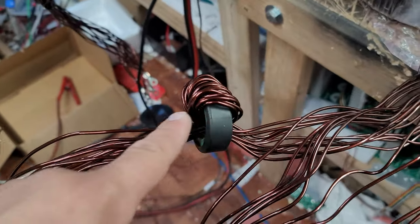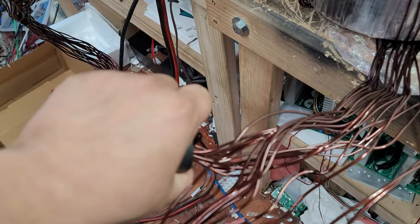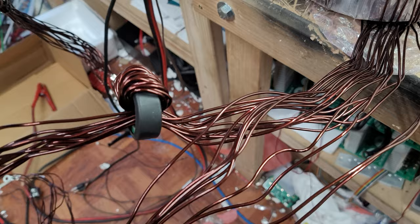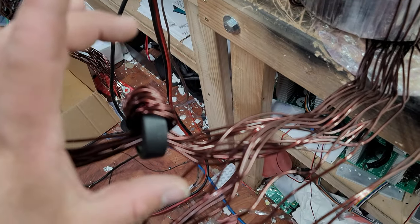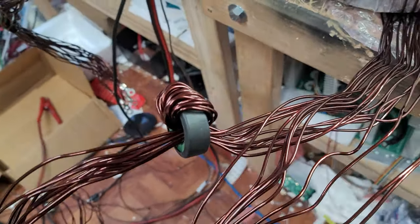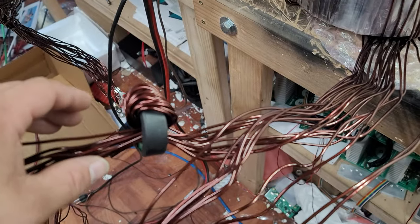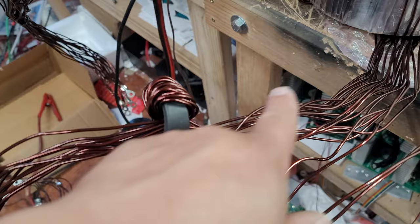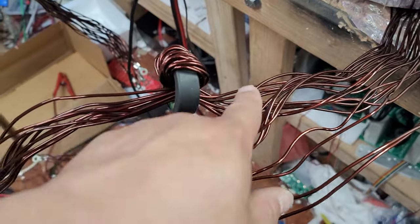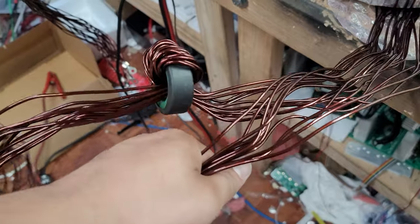Another question I have is: are there any other chokes out there that can actually improve this even further, to the point where you could lower your standby losses with a better choke? I've seen these big blocky square chokes that you wrap around sideways. This is a Powerjack-provided choke — this is what they use. A lot of Powerjack chokes just run the wire through once or not at all. I've got two turns on this choke and I'm about to add another choke on this side.